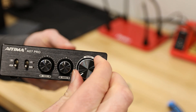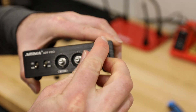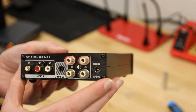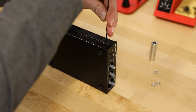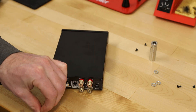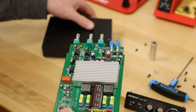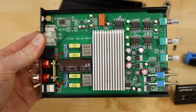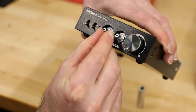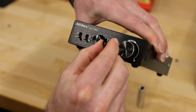Let's see what's inside. Here's a quick demo on how you can take these apart. The knobs pull off with just a little bit of force. Then you can take your 10mm and remove the nuts holding the board to the front faceplate. There are a total of 8 fasteners to remove if you want to completely disassemble it. You could leave the front two if you plan to leave the faceplate on. You can then pull the front faceplate off, or leave it as is since the board can be pulled out from the back freely. For reassembly, make sure to align your tone controls so they are true with neutral — it's a good thing to check this anyway to make sure they were aligned from the factory.